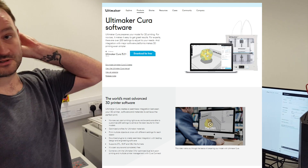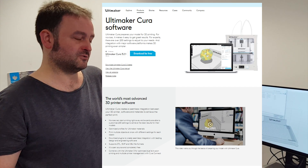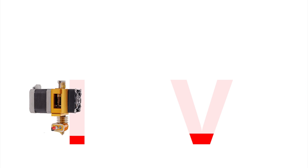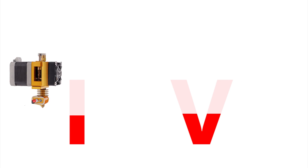Part of the package's function is to import your object and prepare it for printing. Like a standard printer, quality options exist to either produce the equivalent of a draft quality version right through to the highest definition copy, the difference being the time taken to print. The 3D printer could be seen as a standard printer, but the printing head is raised to deposit further and further layers until the total object is formed. The number and thickness of the layers defines how well the object is built and how much time the printing takes.